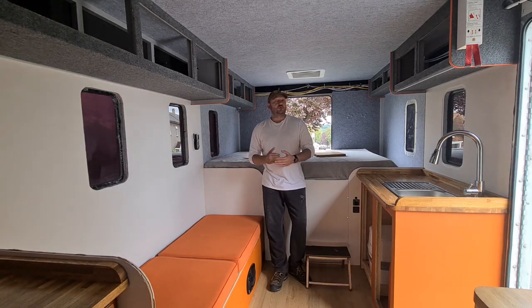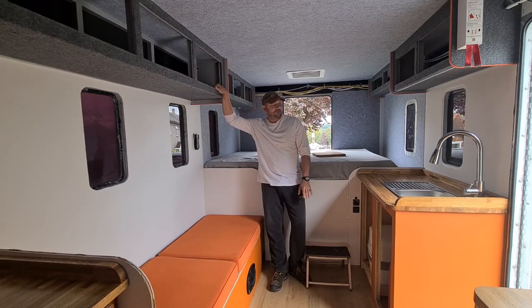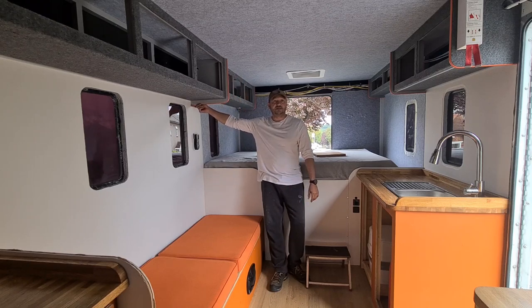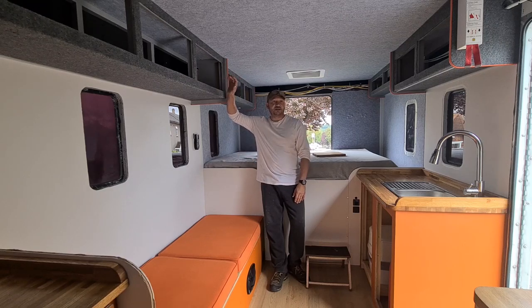I've got all the doors for all the lockers, the overhead lockers, all the doors for the upright cupboards. Everything now has all been cut and prepped. I'm now gonna start routing all the edges so that we can put in this knock-in T-trim edging. Still hasn't arrived, but it's all been ordered. The material for covering the doors has all been ordered. I'm kind of hoping it'll be here today, but today I'm just gonna get the routing done.